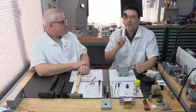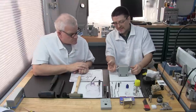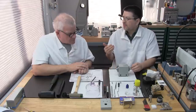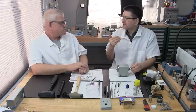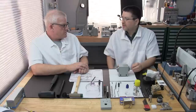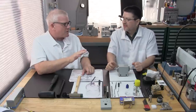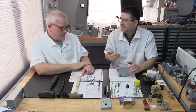That's right. And on one of these headstocks, in part five, we will be regrinding the collet seat, and we will be showing that to you. At this stage, we know we aren't going to do it on the open style headstock because the collet seat's in great condition. There's nothing to grind. And the tolerance, wow, we're measuring a total indicator runout of under 30 millionths of an inch. Really tight. But we'll find one to grind for you. One of these can get ground. It's either going to be this headstock or the 3C closed style headstock.